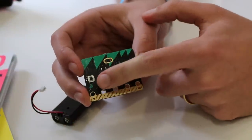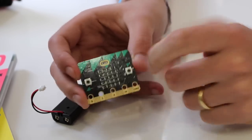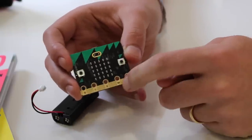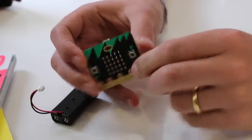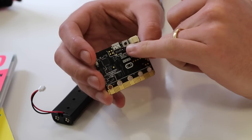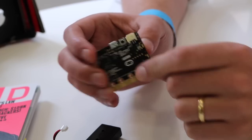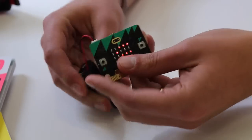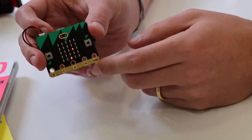As you can see, it's got a little 5x5 LED matrix display. It's got two little face touch buttons here. Along the bottom, it's got this croc clip edge connector, which can be used to provide power and connect it to various other different types of devices. And then on the back, you've got a little USB port, a button which flashes the device, and this connects to the battery pack. You've also got on board a magnetometer, a compass accelerometer, and the ARM Cortex processor chip.